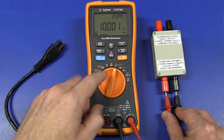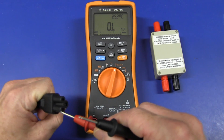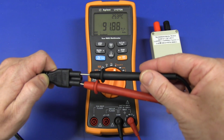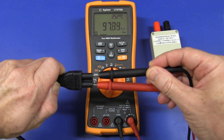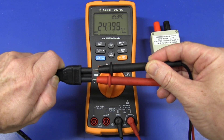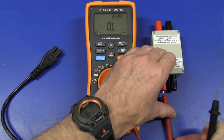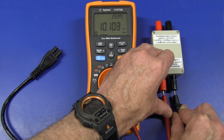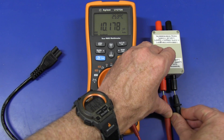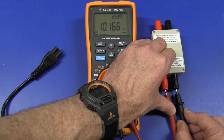Let's start out by revisiting the Agilent — there it is. I've got my 10K precision resistor in here and it's spot on 10K. Now let's stick 240V in here — just be very careful if you're gonna do this test of course. I'm going to leave that there for 10 seconds. And that's about 10. Alright, take it back off and let's put it back on here. We'll find that it's bingo — it's not accurate anymore; in fact it's going up and up, but that will eventually recover. It reached a point and it's now headed back down. Let's try another meter and see what happens.